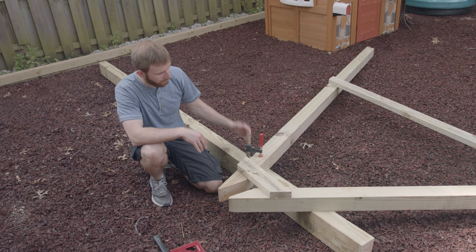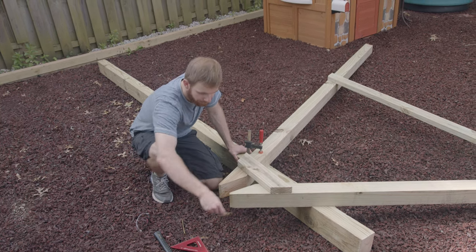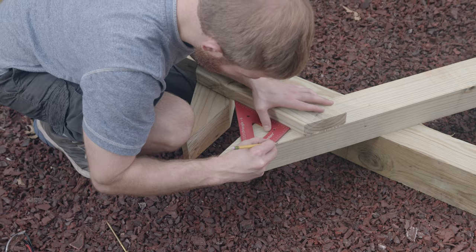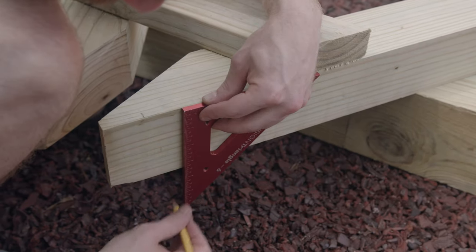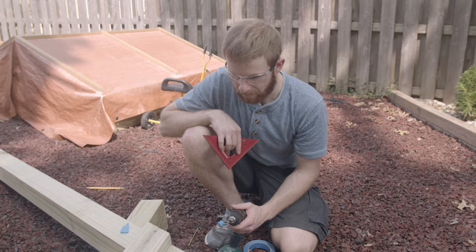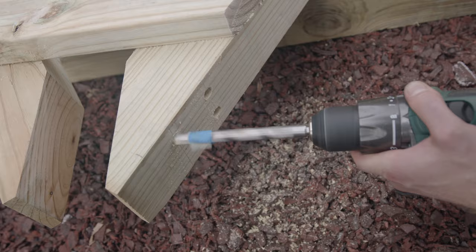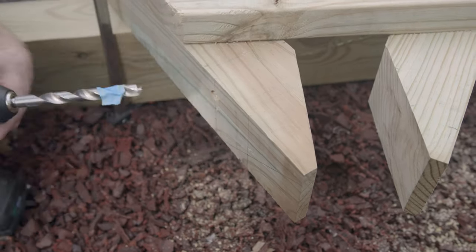So the next step is just to take your A-frame and lean it up against the 4x6, and that's going to give you plenty of working room so that you can pre-drill holes for your lag screws. You're going to measure at 2 inches and mark a line, and at 4 inches mark a line. We're going to have 3 screws right there. So to get these lag screws right where we need to, we're going to need to take a half inch drill bit and then measure exactly a half inch down from the top there and then just put a piece of tape indicating how far you need to drill. And we're going to go in at a straight angle just to create a little pilot hole for the end of that lag screw.